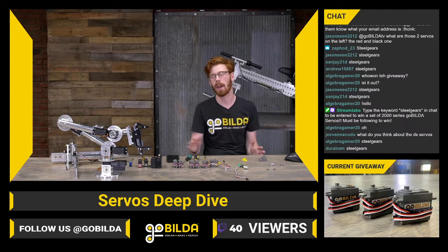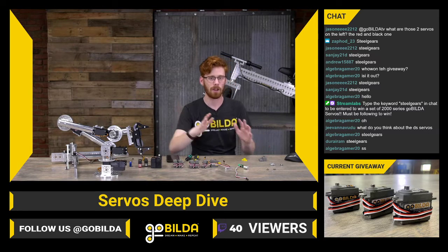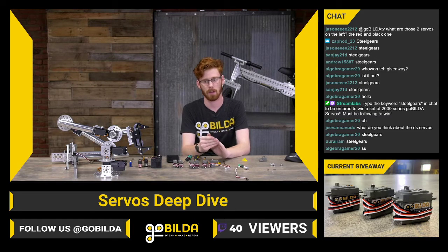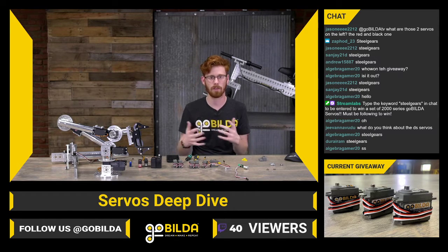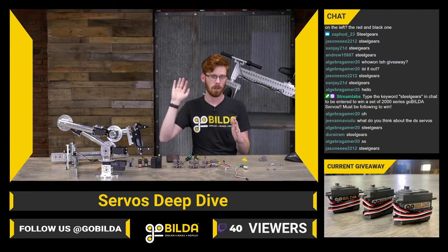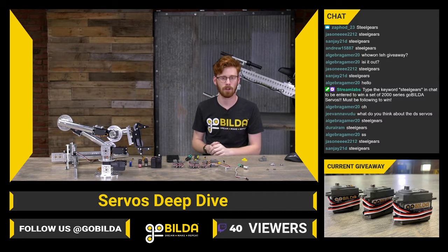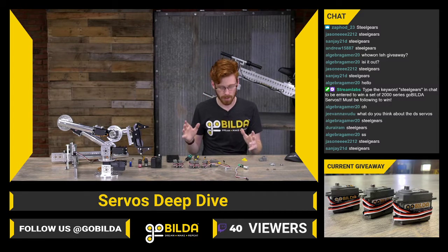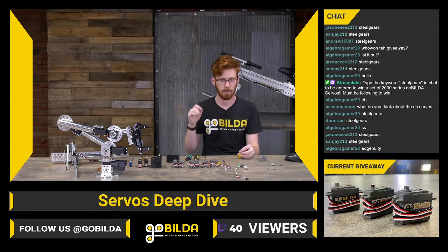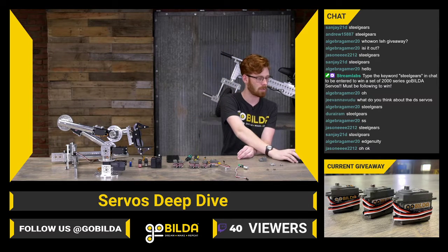They are way more efficient, and especially stall torque is not a very great metric for brushless motors because they don't get all the advantages of being a brushless motor. Where they really shine is when you're running throughout a rotation and you can get magnet alignment after alignment. So stall torque is not the place they really shine. Where brushless systems shine is the peak power output of 50% of their stall load. That's where they're really awesome.